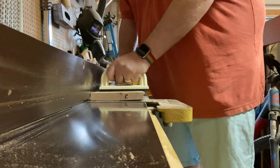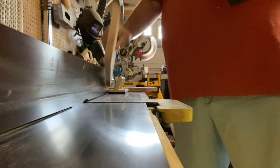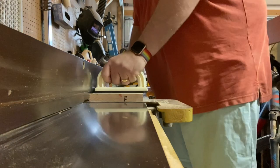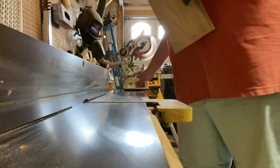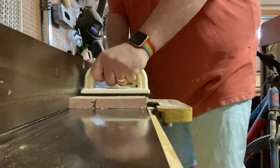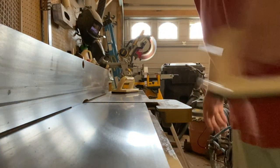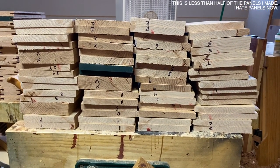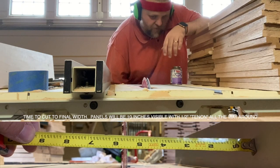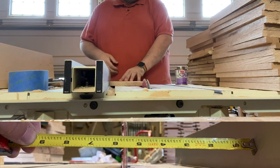At the end of the day, I ended up having to make about 60 panels, which feels like a lot. Each one of these required two half-panels per panel. The final dimensions were something like 10 and a half or 11 inches wide by 13 or 14 inches tall. Here they all are numbered so I can open them up and have the bookmatching work. Now it's time to cut things to final width — five and a half inches wide, so my combined width once I glue them up will be 11 inches.